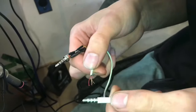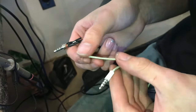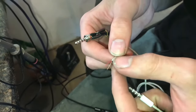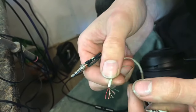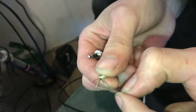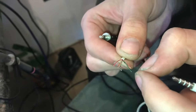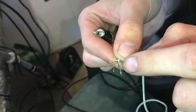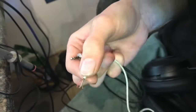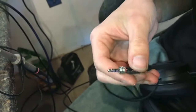A lot of people have headphone jacks lying around and you can just clip them off and strip back the wires, but these are actually pretty difficult to solder. They're very thin, coated in enamel, and sometimes there are even strands of nylon plastic twisted and braided with the copper — it can actually be a lot more work than you're in for.